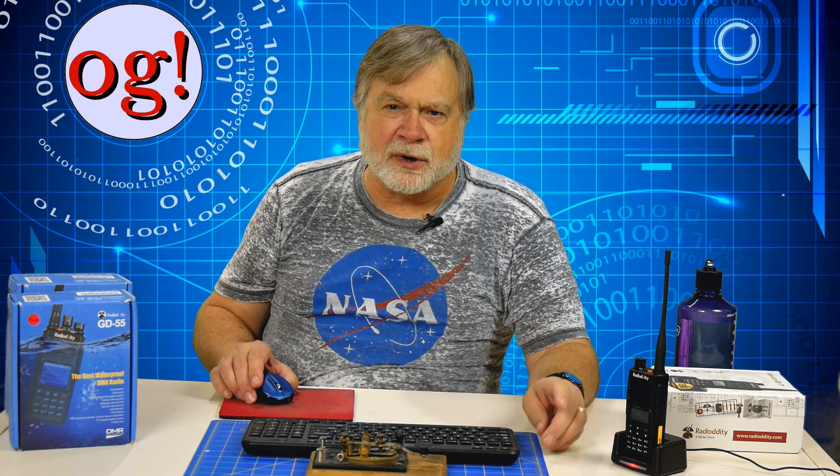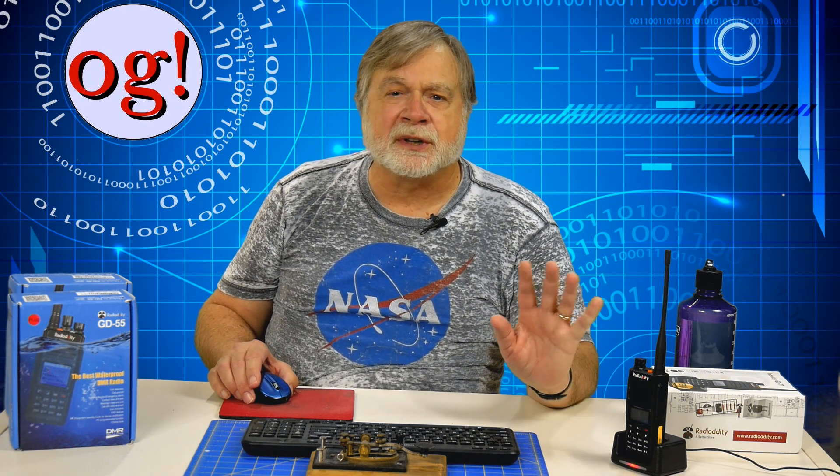The radio is capable of normal FM, but it's clear FM is not the radio's primary purpose. There's no VFO mode where you can punch in the frequency — rather you have to select a channel and pre-program it, even for analog. It is said this can be done via the front panel, though I haven't seen that myself. The settings are easy via the programming software. You can mix and match channels between FM and DMR with a couple of mouse clicks in programming mode. I set up a channel with our local FM repeater and it works fine.